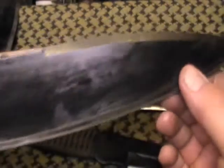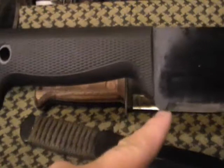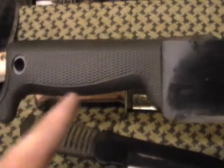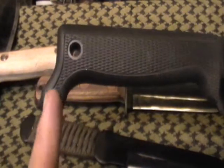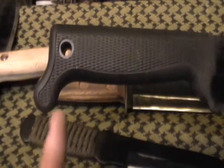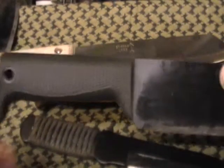Not very good when you want to hit the top of the knife across the spine to batten through wood. So in terms of bushcraft, it's not the best thing in the world. It also weakens the tip, so it's more of a fighting blade. But if you have a look at this handle here, a very simple cutout has created a handle. Now that could be square, this little bit at the end, this rear back end here. That could be just square and still serve the same purpose. So in terms of what you've got to do to cut it out, cut there, stop about maybe there, and you could cut all this out here.